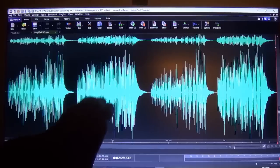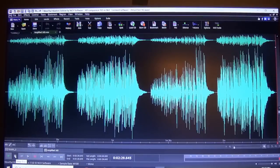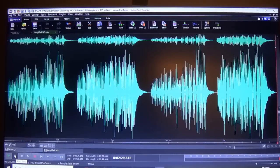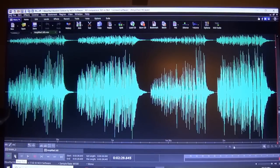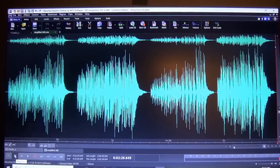This is a warmer, fuller tone, but I think that the 864 tone would benefit from some enhanced treble. It needs to be cleaned up a little bit, a little clearer. In fact, you might just be able to turn up the treble tone control and end up with excellent tone with the 864. However, I don't think much that you can do, including cranking up the volume, is going to help the 165 circuit. To me, this one isn't perfect, the 864, but it's fixable, easily fixable, and it's much closer to what we expect from a Fender Bassman than this rather weak, tinny sounding tone that we're getting from the 165.